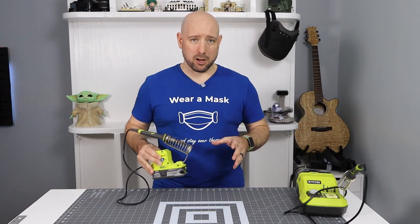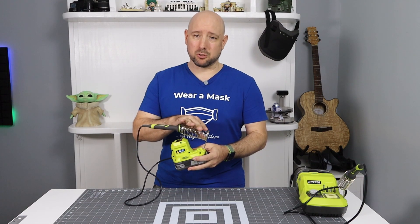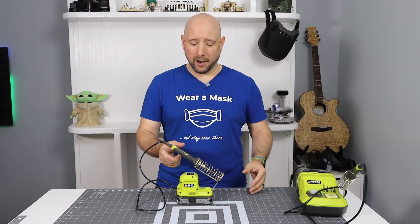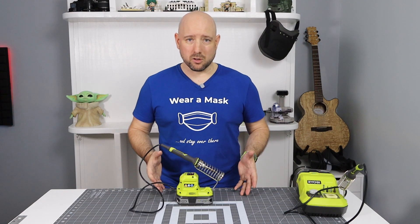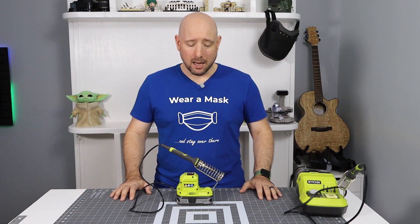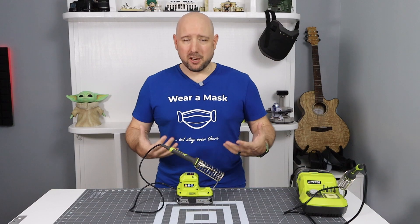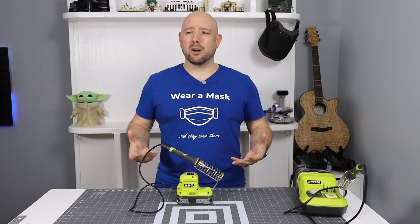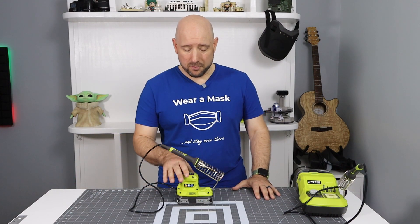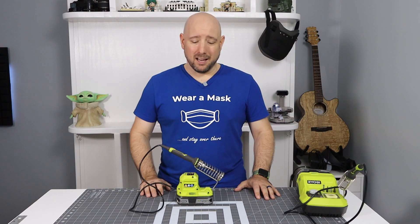Both tools use standard Hakko T18 tips. I'm using an extended pencil tip on my soldering iron and a bent pencil tip on my soldering station. It sits on its battery so you don't have to worry about where you place your iron — just slide it into the ring and put it on any level surface. Most of what I do isn't sitting around soldering for hours on end. Once in a while I put on a pin header or solder up a significant project doing 30 to 50 solders in a sitting, but usually it's four or five wires here or there. For that, this portable soldering iron that heats very quickly is an ideal tool.